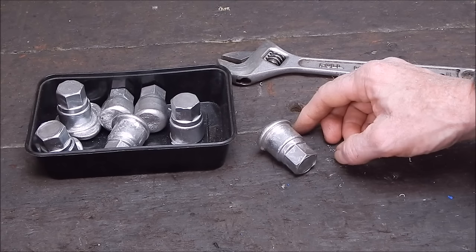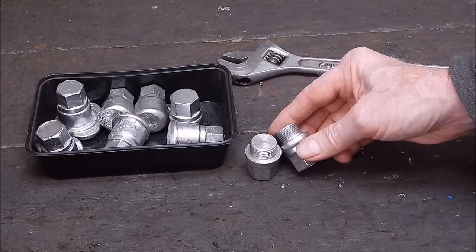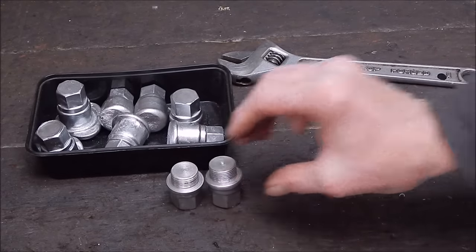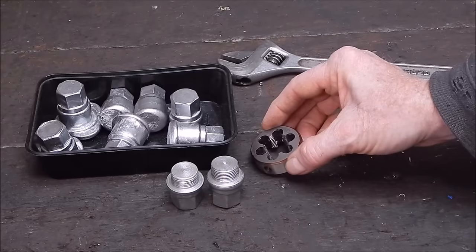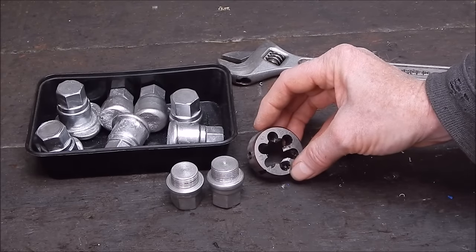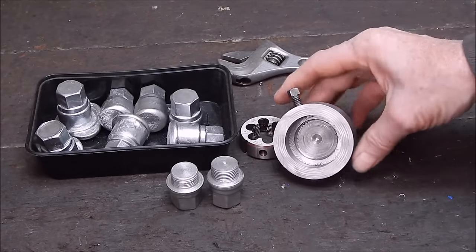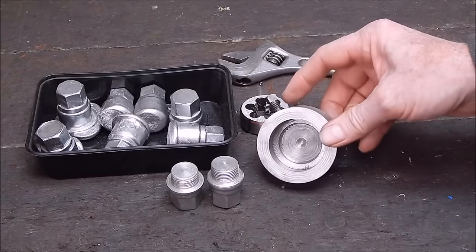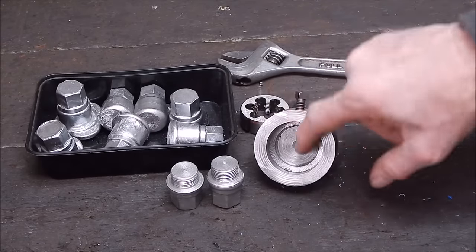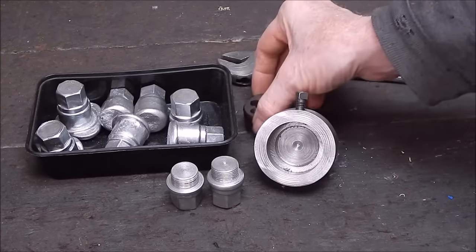So now I'm back on this project. I've cut threads on two of them and they turned out pretty good, but I cheated - I didn't go with single point threading, I just couldn't be bothered. For ten bucks I got a nice die from China. That way you get a proper formed thread, and being aluminium you don't want it tearing up - it's got to be a good fit. So that's a 22 by 1.5. I then had to make a die holder for it, which I knocked up out of some old stock I got from the scrap yard. Turned out pretty good. I put a bit of recess in the back so that gives extra space to feed through, even though I only really need the depth of the thread.